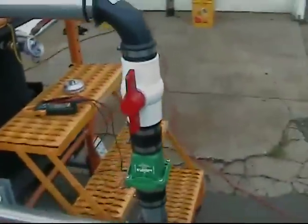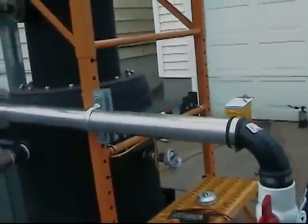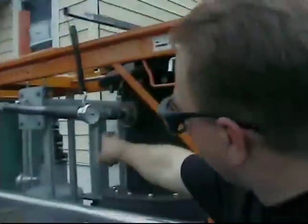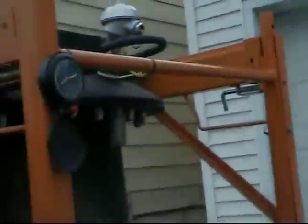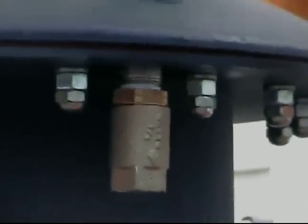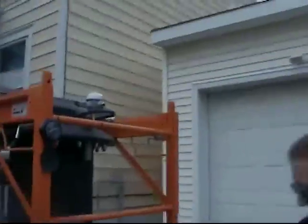Gas back into the system, but I also have two check valves here. So not only is this spring loaded for the hopper lid, but I have two check valves here, one here and one here, that in the event of a positive pressure situation inside this hopper, it'll blow out those check valves, so it'll relieve pressure through those check valves. I just want to point that out because that was one thing that I missed earlier. So I'll put this back together.